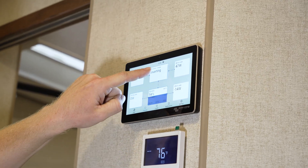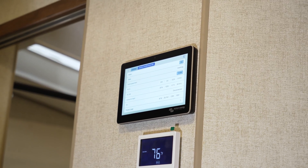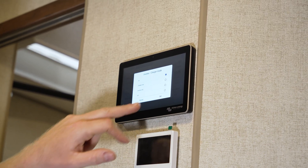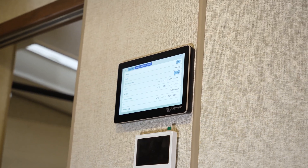The best way to do this is to use the touchscreen. You'll double-click where it says inverter on your overview page, and then on mode where it's set to on, you can click on that, set it to off, and click set. Now the inverter's off.